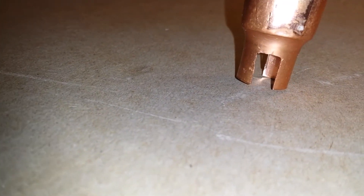Basically the idea is you'd want to center that wire over your pre-drilled hole, and the window lets you see that you're in the right place. Then you can spot weld with a consistent gap between the tip and what you're welding. I just thought I'd give it a try without having to order the one sold by Lincoln or Eastwood. It'll probably be handy too if you're working in a tight space where it's hard to make sure you've got your angle and gap right.